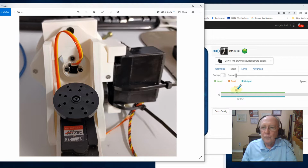So with that set like that, when I move my slider down to 0, my servo motor is going to continuously run trying to get to 0. And it's never going to time out on me on the auto stop feature. It'll hit 0 and run past 0 and back and forth, right? Very slowly, so that I have reaction time.